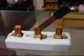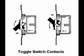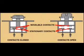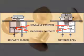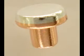However, a good switch design must be rugged and reliable, and avoid presenting the operator with the possibility of electric shock. The conductive parts in a switch used to make and break the electrical connection are called contacts. Contacts are typically made of silver or silver-cadmium alloy whose conductive properties are not significantly compromised by surface corrosion or oxidation. Gold contacts exhibit the best corrosion resistance, but are limited in current capability and may cold weld if brought together with high mechanical force. Whatever the choice of metal, the switch contacts are guided by a mechanism ensuring square and even contact for maximum reliability and minimum resistance.